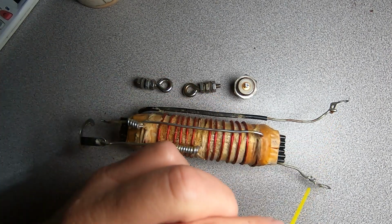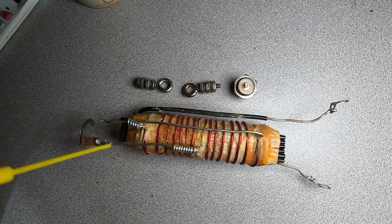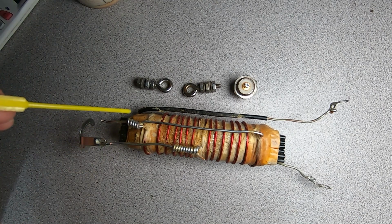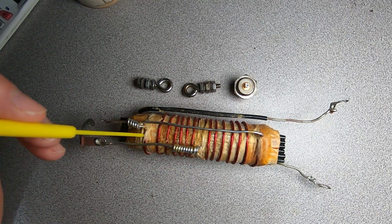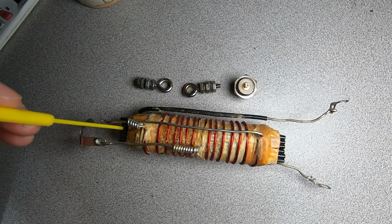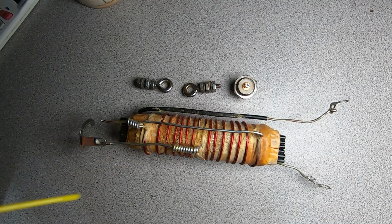All of the connection points in the transformer, everything is soldered together. The selection of hardware in the construction of this device is of excellent quality. The wire for the transformer at all of its structure points is laced and tied like an aviation wiring harness. And the core material, the wire, the insulation, the whole kit and caboodle appears to be lacquered after construction, so very cool.